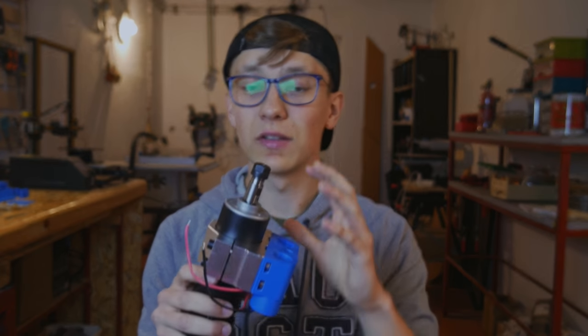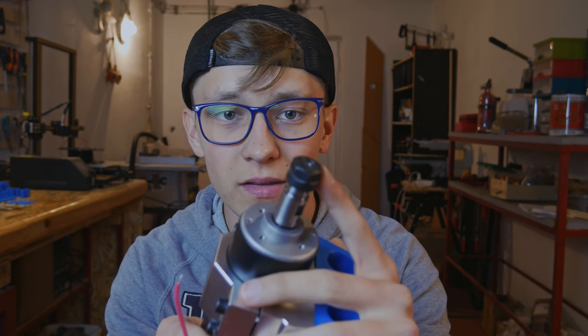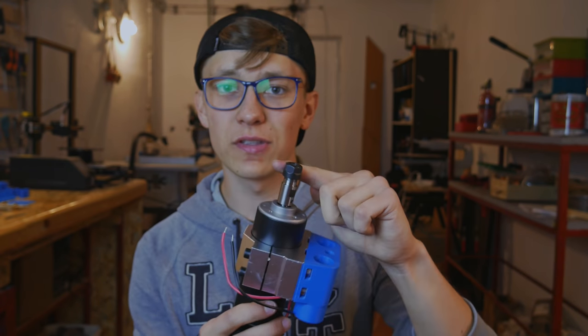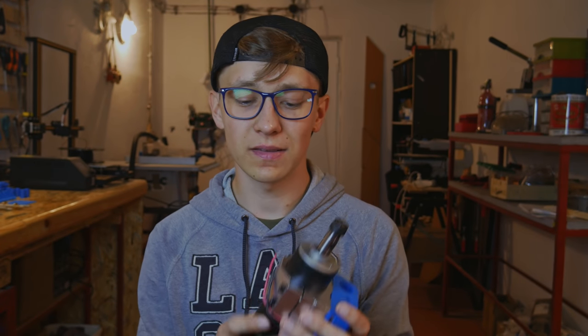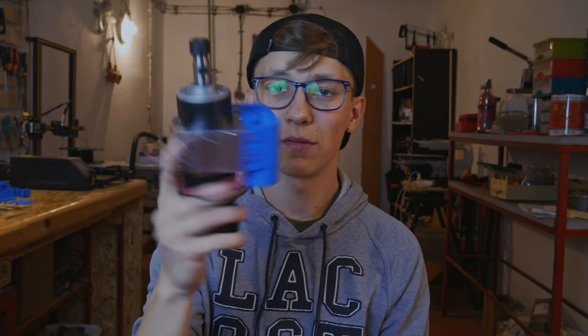It's a little bit more expensive, a little bit more powerful, but the biggest advantage of this spindle is this collet — you can mount a lot of different bits. With Dremel you can use only bits with 1/8th of an inch shank, but with this thing you can change the collet and use pretty much everything up to I think 6mm or so. In this video I'm not going to make an in-depth test of the spindle — that will be one of my next videos.